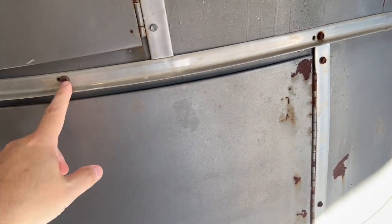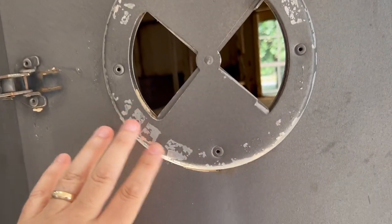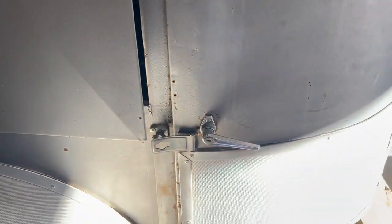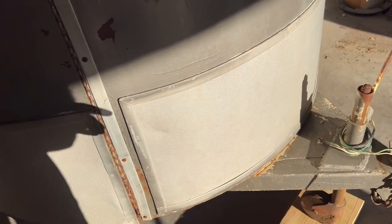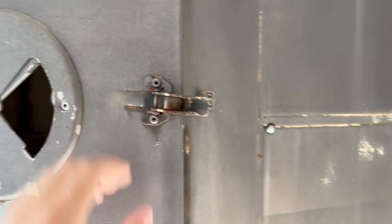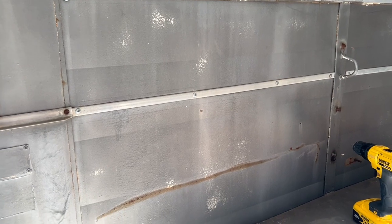I'll show you how to remove those — it's just a drill with a bit on it. They did paint over the aluminum on the butterfly vents, so I'll drill out these rivets and put new butterfly vents on. The doors have got padlock latches — they probably lost the key — so I'll be removing those. This door trim I'll remove; it's in real good shape, there's a couple of dents and dings but that adds character. This flashing is all rock guard — I like to remove all that and replace it with diamond tread aluminum because it looks really sharp. I'll replace these latches with ones that have a spot for a padlock, just to make the trailer more secure since we're going to have valuable things in here and not just use it for hauling horses.